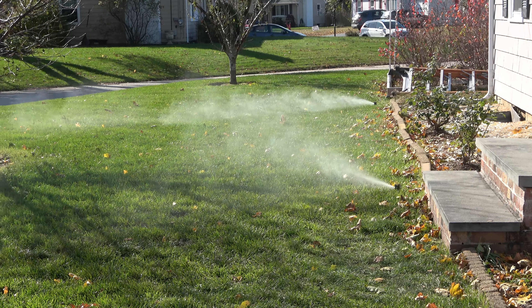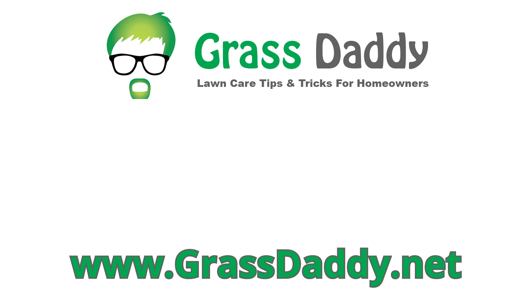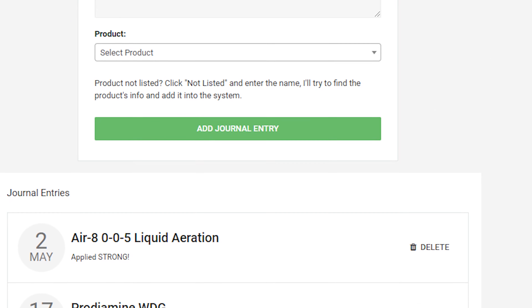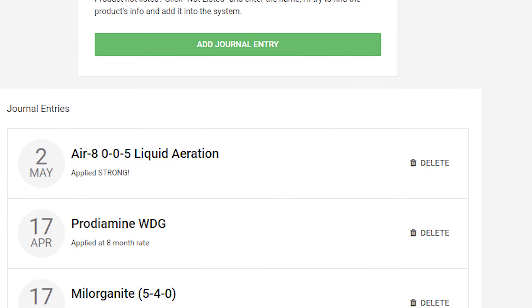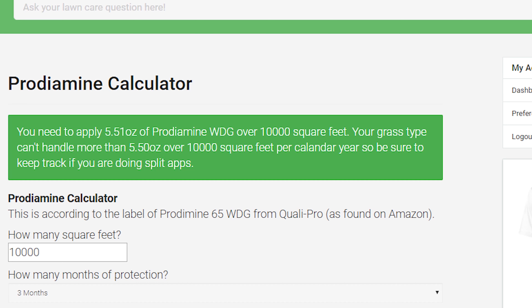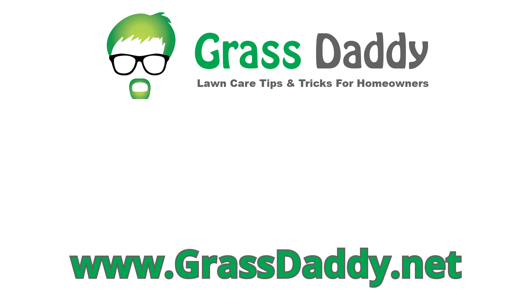I did trip the breaker, and once I plugged it in correctly it worked a lot better — much faster, because of the tank size and the pressure. It actually did pretty well without running, but it does go a lot quicker when it kicks on correctly. Essentially what you're looking for is the sprinkler heads to start spinning quicker, because that's when it's just air. If it starts spinning super fast with a lot of high pressure, it'll actually spin much faster than normal and you can melt the sprinkler heads that way. You don't want to see water coming out — you want to see basically just air.